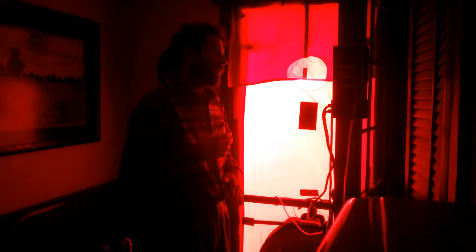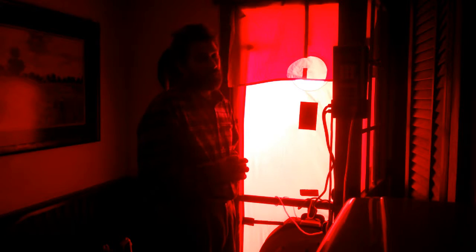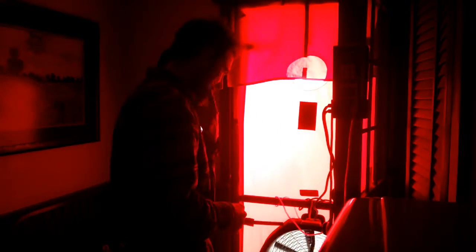I have the house all set up and ready to go for the blower door testing, so I'm going to pull my plate off the front and fire this door up so we can see what our air leak reduction was. I'm going to try to depressurize to negative 50 pascals. I'm not getting enough air through that fan because the building is so well air sealed now that I have to put it in a smaller ring.